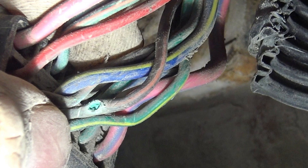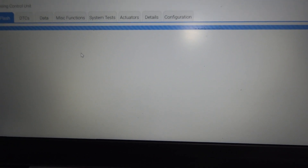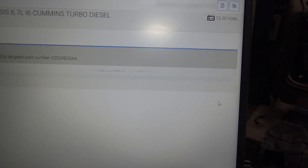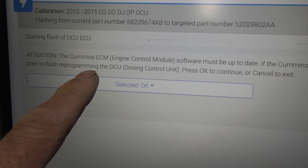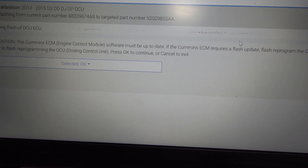And there's the problem right there. At first I did back-probe this, and then I was testing open circuit. If you have a bad result with it back-probed, you can always test for an open circuit — but do not open-circuit test unless you know what you're doing. In this instance, as you see here, I had open-circuit testing going on and we had 2.6 volts. We had a bad spot in the wire. We got our DCU dosing control unit back online, going to go ahead and flash this. Make sure the Cummins engine control module is up to the latest calibration before you flash the doser.